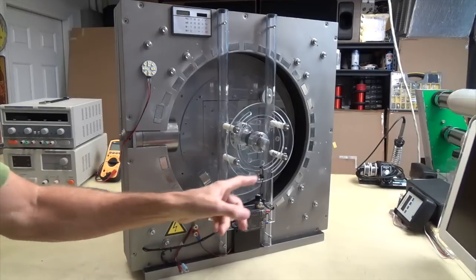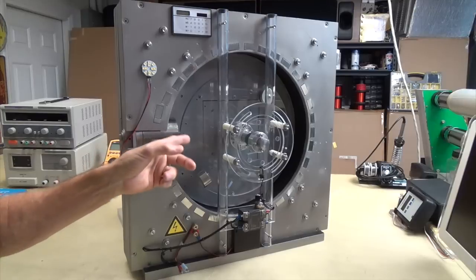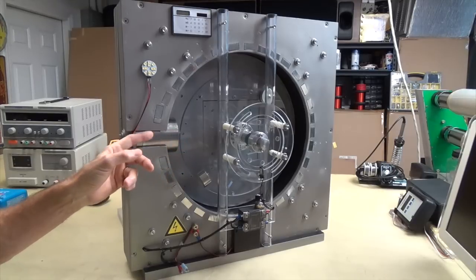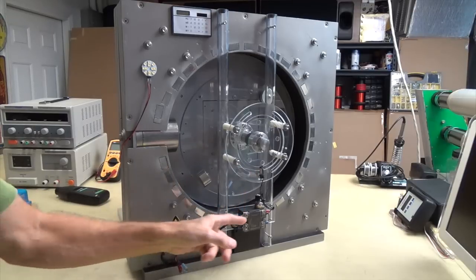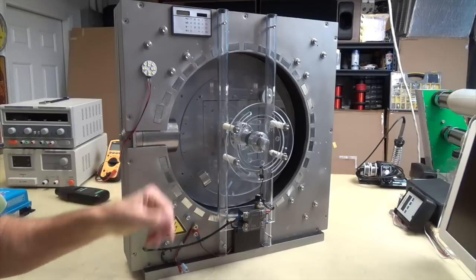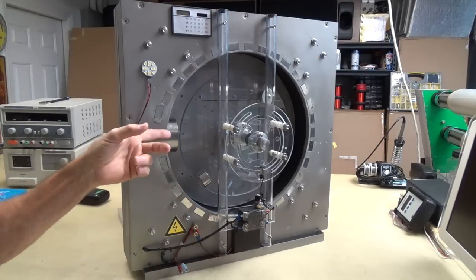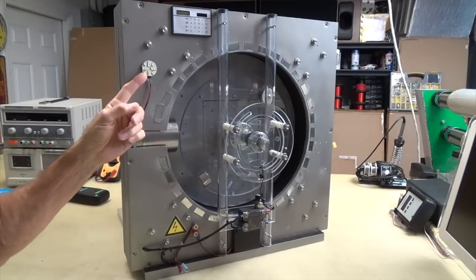But the reed switch that I've got here that controls the pulsing for this, because it's only a fraction of a second that this pulses, that reed switch is the exact same one, 13 years. The solid state relay that I have down here for the field effect transistors, 13 years. Same thing. Nothing's worn out. The same electromagnet. Everything's identically the same except for those little additions. This isn't a part of it.